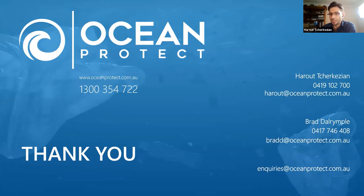Scott McMillan, how do ocean guards remove nitrogen and phosphorus? Look, with your basket type devices, it's a dry sump system. It's not like your gross pollutant traps that hold water permanently, so you limit your nutrient capture. An ocean guard holds the pollutants dry, limiting the organic breakdown. So you're talking about particulate or larger matter, obviously.